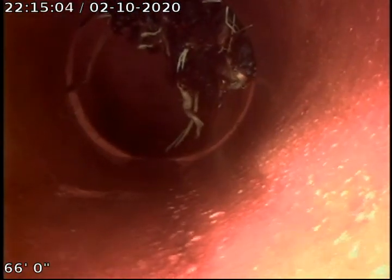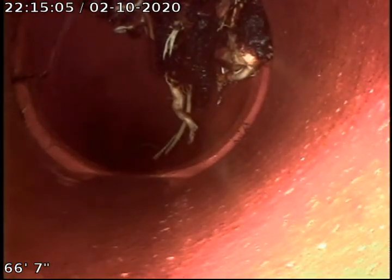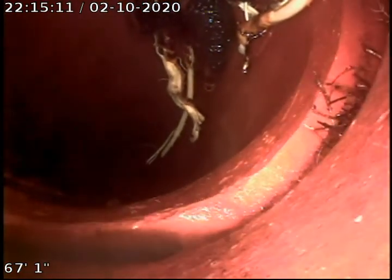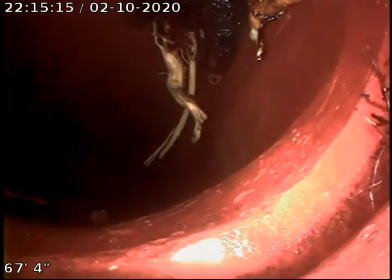And we have the large break off at the 9 o'clock area. We also have a large break right now at about the 7 o'clock area. Kind of hard to see, but that's the crack right off to that area heading toward the middle of the pipe. This area definitely has to be replaced.